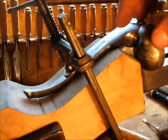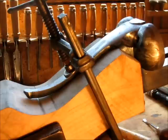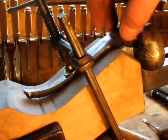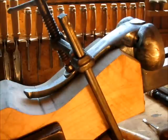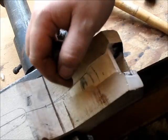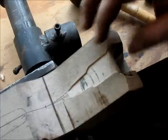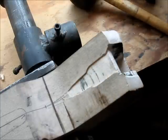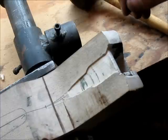I'll pull this out here in a second, and I'll show you what it looks like inside, so that you can see the opposite image of the action in the wood and where the high spots are, so that you can see how it looks when I'm actually scraping this. So you can see that these are the high spots after this touching, and all that has to be taken down and worked down just a little at a time. And it's just done by using chisels and scrapers, and just keep working my way down in there.